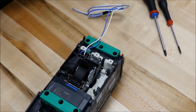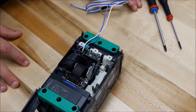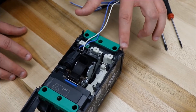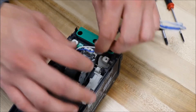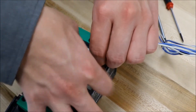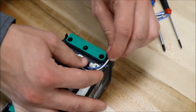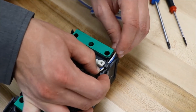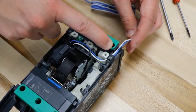In the instructions, multiple ways are shown to route the wires out of the circuit breaker. For this video we'll be showing how to route out of the top right corner of the breaker. You'll take the wires and place them under these two tabs above the handle and then under the SD slot and out of this top right wire way in the breaker.